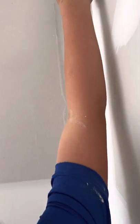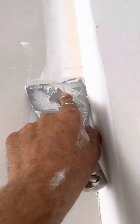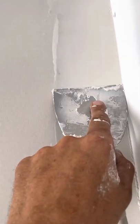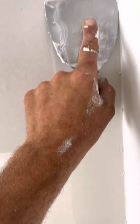Okay, now go up there and do the same thing you just did from the bottom. Let me tell you what he's doing — let me show you. What he's doing is holding his knife at an angle like this, and what it's doing is this part of the knife right here is cutting into that angle. You've got to be dead at 90 degrees. If you get it 90 degrees and you keep your blade clean — if you keep your knife pretty clean so there's not a lot of slop on it — you don't want to push hard.